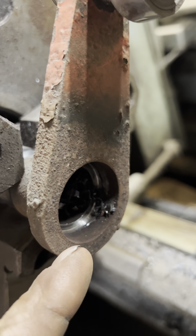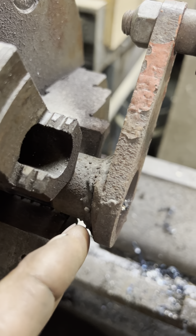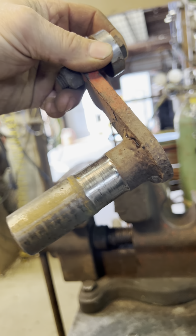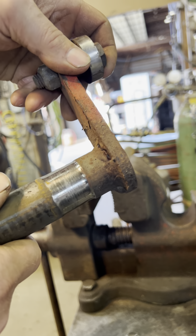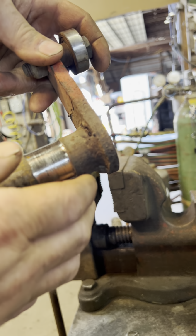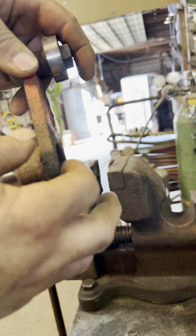It undercuts that a long ways. Now if I go in here with my cutting wheel, I don't have so much to go through and it comes off easily. So there's multiple ways of getting this piece we need off from this pipe. One is torching it, one is sawzall, grind, and knock out this inner part that came through.